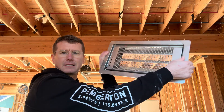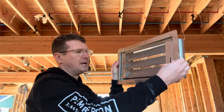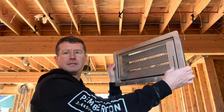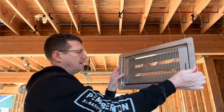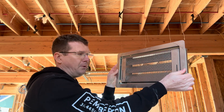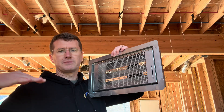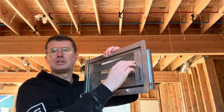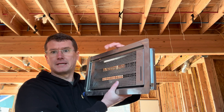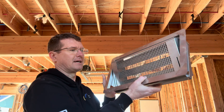What does it do? If you notice, it's kind of holey — you can see through it. It's got these flaps which help prevent air and other things going through. If I push on it right now, it doesn't open. But there are these little slits here, and over here there's a little float. As the flood water comes, it hits that float, the float comes up, and it unlocks this swing gate.